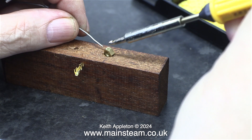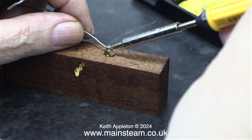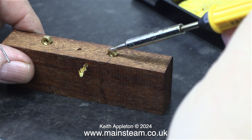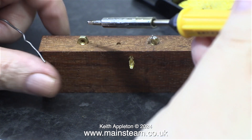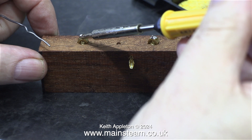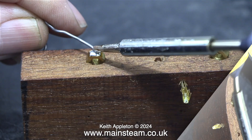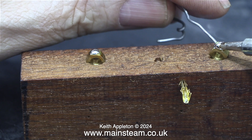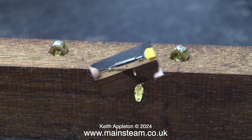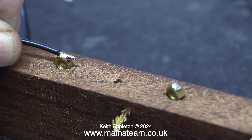In this clip I'm showing soldering the other ends of the pieces of wire to each of these nuts. The nuts take a little longer to get hot because they're physically larger. This process is known as tinning. The parts that you're soldering need to be at the correct temperature. If the parts are not hot enough, you will get what's known as a dry joint. You can usually see when it's like this because the surface is dull, but if you look at these, the surface of the solder is very shiny. I'm holding the wire in position on the nut, and the solder on the wire and the solder on the nut flows together — it's not a dry joint, it's still nice and shiny. I repeat the process for the other nut.